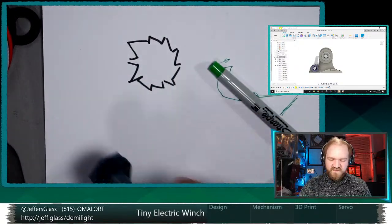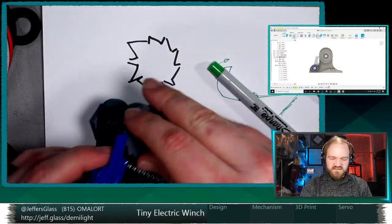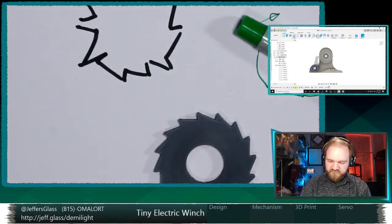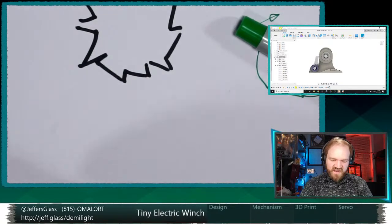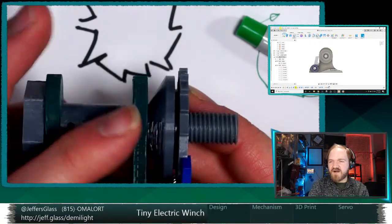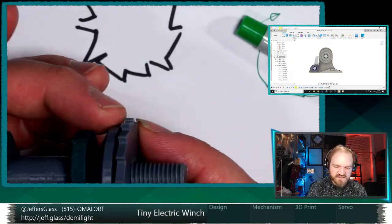But one of the things I'm thinking about, he said, looking over at the 88% done print that they'll test in a second, is get this friction wheel back off here to play with. Because we have all of this airspace, if you will, between the ratchet wheel and the frame, and we don't necessarily need that much, right? This shoulder is probably unnecessarily big, especially if we're going to print with additional supports.